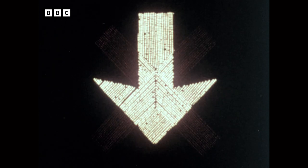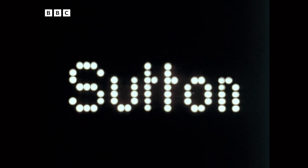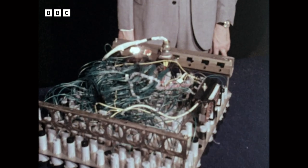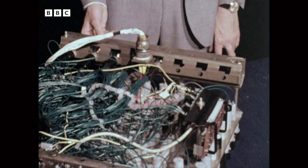This advantage applies both to traffic signs and to large signs on motorways. Fibre optics provide other advantages: the fibres can carry tremendously bright light from only one lamp, thus saving costs. And above all, with high-speed traffic relying on accurate information from the signs, they can be made fail-safe. Some of the fibres can be set to look inwards at the light source and carry a sample light to a photosensitive cell. If the light goes out, the cell triggers a standby bulb in less than a second.